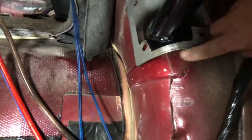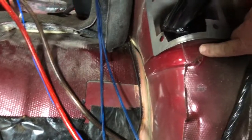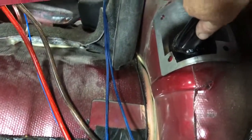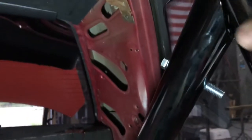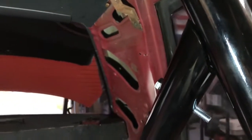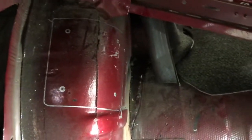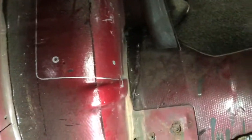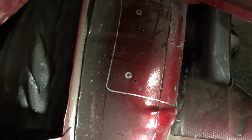I got to mark where this sits on the fender well and get rid of this stuff here, because he really wants this to be welded into place. That means I got to prep this joint and get rid of that bolt once it's all in place — I'm gonna finish weld this rather than have some bolt hold it together. Back here where the supports go right on the fender well, there's another big wad — I don't know what that is, might be Ford sound deadening.